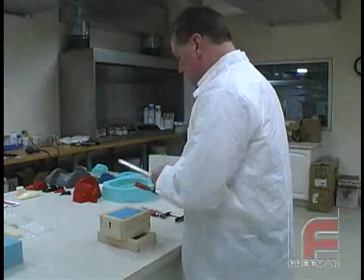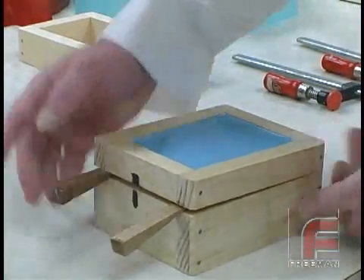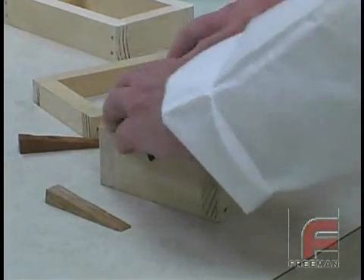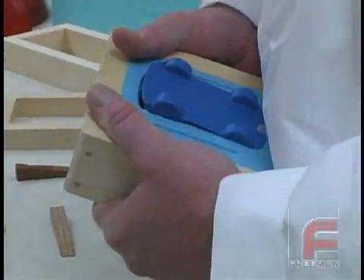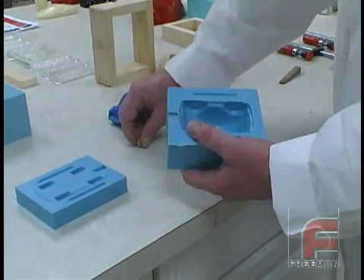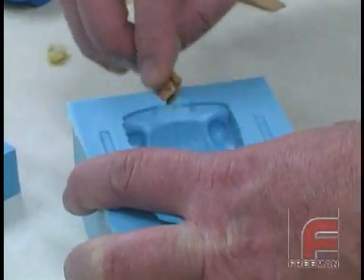It has been 16 hours since we poured the second part of our mold. The silicone is now hard and ready to be demolded. First, we take the clamps off, and using the same wedges as before, we separate the frame at our parting line. Since we waxed our frame, it actually comes off first, and then we separate the mold. Notice our locking device has transferred perfectly from one half to the other. We push the first half out of its frame and then remove the lower part of the gate. Notice that our gate needs to be cleaned up a little bit, which we can take care of with sandpaper, much as we did when cleaning the flash around the locking mechanism.